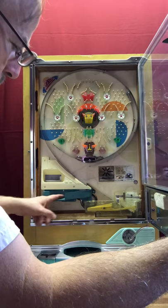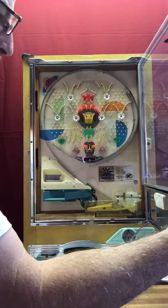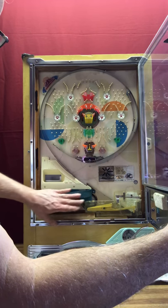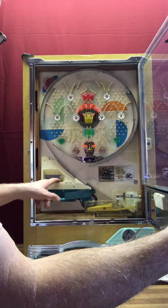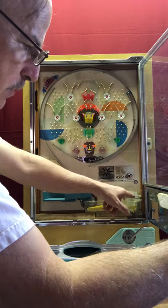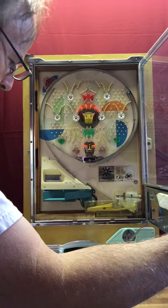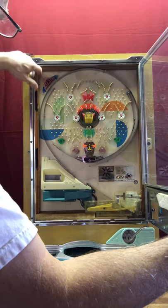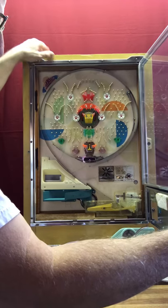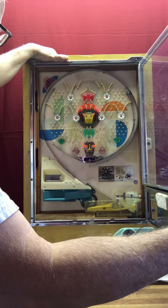These plastic parts — typically when you find pachinko machines in people's basements and barns — they're just absolutely filthy. These have all been cleaned up and all the plastic parts have been waxed. Every part gets taken apart individually, and the brass gets all cleaned back up to nice and shiny. All of the wood that's in here and on the backside of the machine gets sanded down and polyurethaned so that it doesn't absorb any moisture.